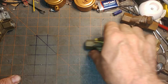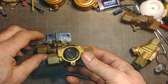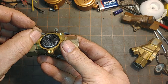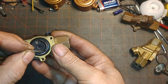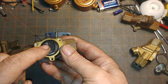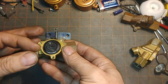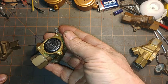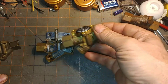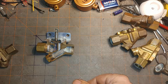What can happen over time is this — the internal diaphragm, shown here in cutaway — has two little holes, one there and one there. If both of them get clogged, the unit will not shut. You need to get the repair kit and take this apart following the instructions. Hydro Level has instructions on how to rebuild these units, and you can repair the valve fairly easily and put it back into service.